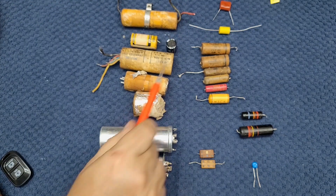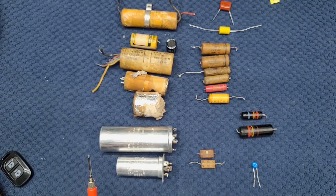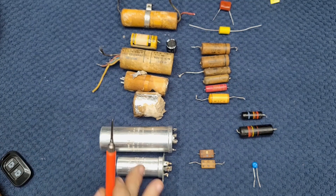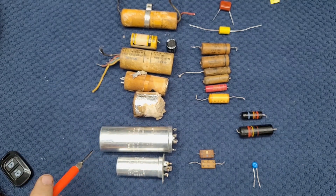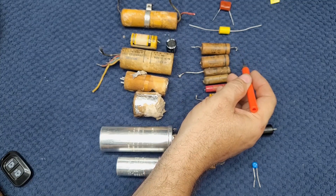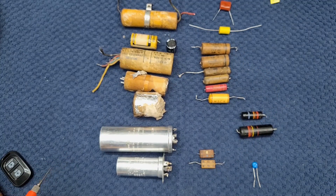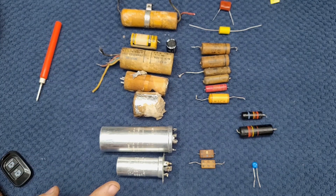So that's kind of the scoop on capacitors — we're not going to fool around with this type of stuff, out it goes straight into the trash. Don't take a wait-and-see approach. Don't say your tester said it was good. Capacitor testers probably don't test them under load at 360 or 450 volts — that's where they begin to break down. And if you've got a coupling capacitor to the next stage, like to an audio tube, and it's shorted and you're getting DC across that capacitor — if it's passing DC, it can load an audio tube down until the plate is glowing red hot and burn the tube up, and a lot of components, and potentially hurt the audio output transformer. So we're not going to play around — we're just going to throw them in the garbage.